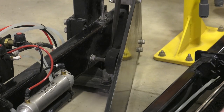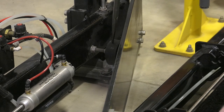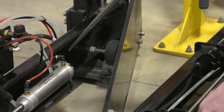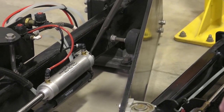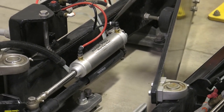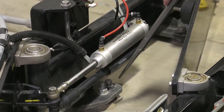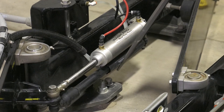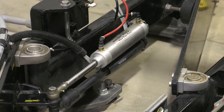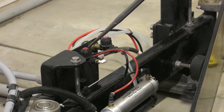Towards the middle of the brush, we need to inspect the bumper. It will wear out — it's a wearable item — so it needs to be monitored for wear. We also have our clevis here where the rear of the air cylinder attaches; we need to make sure the hardware is tight and sound. We also need to check the anchors periodically — anything attached to the floor needs to be checked and tightened. We also have check valves here; we're looking for leaks and problems with chemical application.